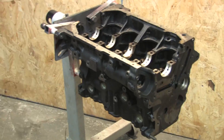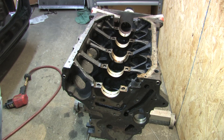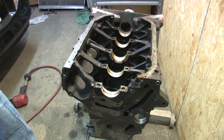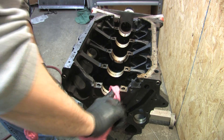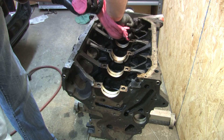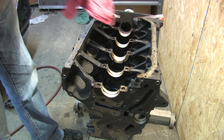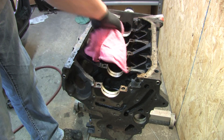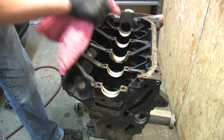So now I'm going to look at the main bearings, because what I want to determine is what the oil specs are and what my oil gap might be on each one of the mains. That gives me some other good info. Real quick, I'm just going to wipe out these bearings to not get myself all messy. Another important thing to do before doing this measurement or the reassembly is to make sure you wipe down all your caps — you don't want any junk on those.